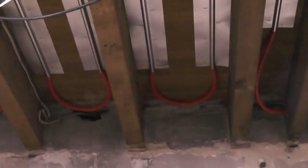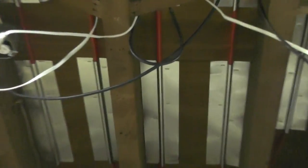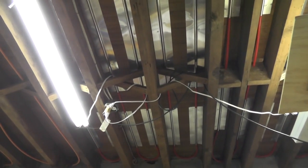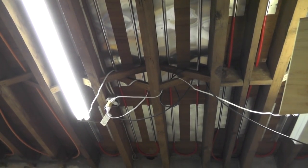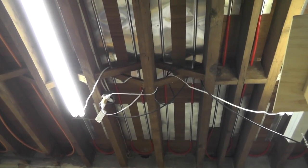I did crossovers on this side and then down at the other end did the loopbacks. With this setup I also installed aluminum omega-shaped plates — the PEX tubing snaps right into them, wrapping around the tube. I got two different sizes: two-foot longs and four-foot longs, because they fit better in my joist bays. I used fours to fill the gap and twos for the remainder.